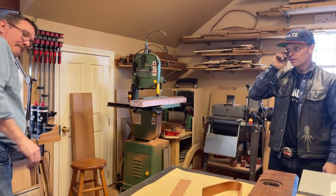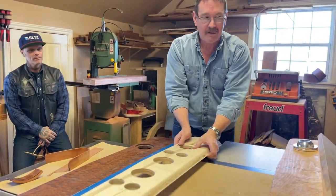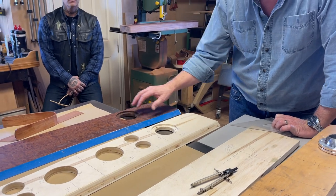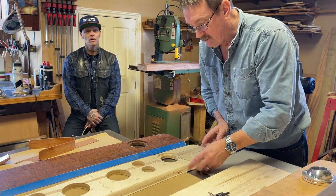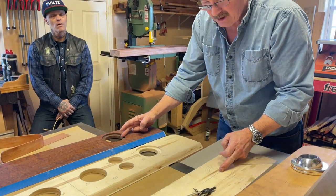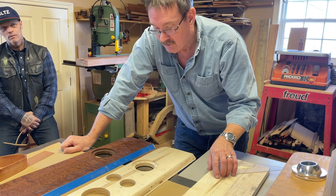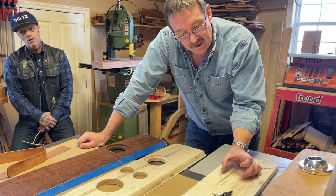Die grinder and a chisel? Yep. And a big old sledgehammer. So, actually, what I did, I used this as a dummy. I tried to figure out what I was going to do with this. I found the length here, the on center length, scribed a line here, found the center this way, scribed a line that way. Then I wanted these bolt holes to be exactly 6 o'clock, 2 and 10 o'clock. And how I was going to do that was figure out the offset of this hole on the ring, which happens to be 1/4 inch. So I made another ring here.